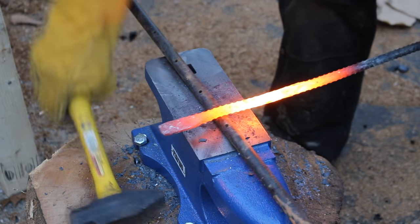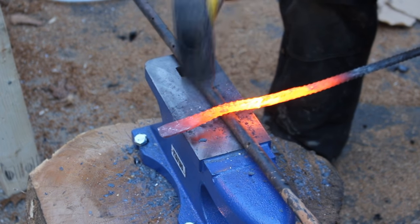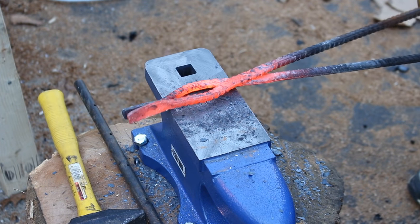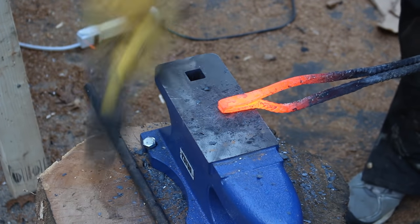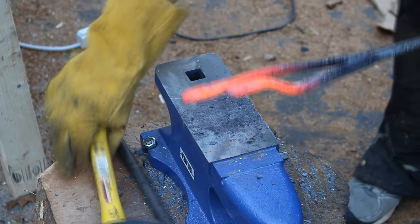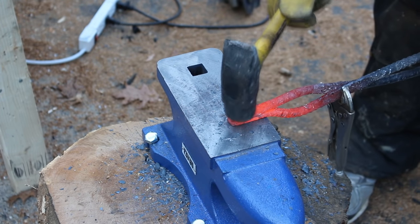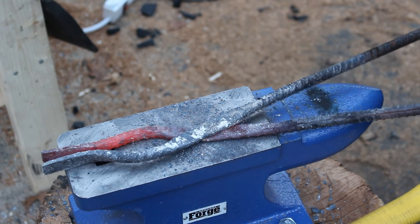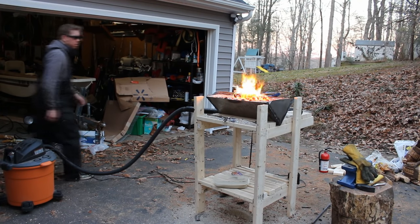Use a one-inch mason stake or some round piece of sturdy steel and beat the piece over the edge of it to give it a nice curve. Put them together and make sure they kind of match, then sandwich them together and beat them so the teeth connect flush with each other. Watch that carefully and get it to line up exactly — you can use the vice grips to help. Once you've got it looking right, test them out and make sure they feel right. Then you're done with the forging part and ready to drill the holes and set the rivets.